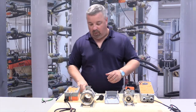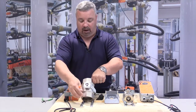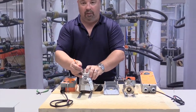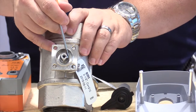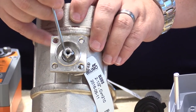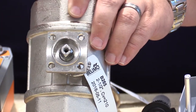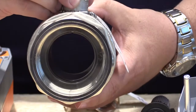So, the pin removal. Here we have a valve body — a characterized control valve body. You'll notice that we have three grooves on the stem and one of the corners is notched slightly. These grooves will show the valve position. When the grooves are aligned with the pipe, that means the valve is open, as you can see.